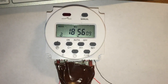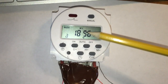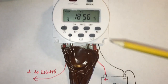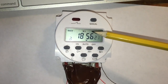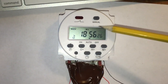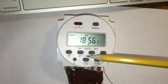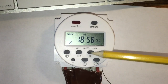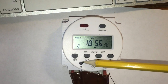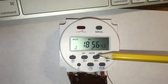One little word on the operation of this thing. What I found is that sometimes the screen is totally blank until you plug in your power source. Once you plug in your power source, this thing will generally wake up. You'll hit the C button which will reset everything and it comes to life. You can then do your programming. Go ahead and do your programming quickly without waiting a lot of time, because it'll go to sleep and then all your buttons will lock up.